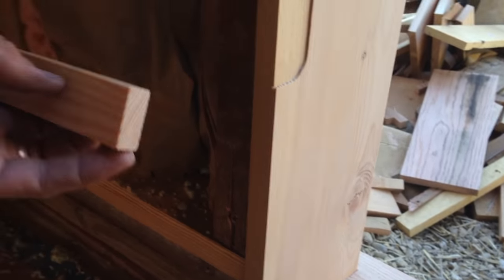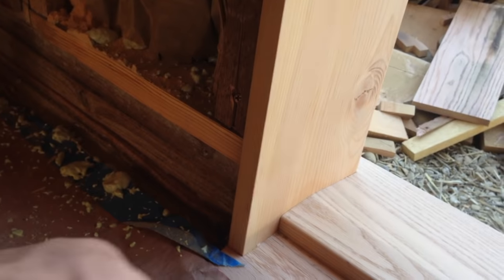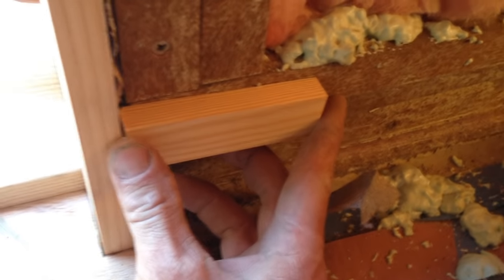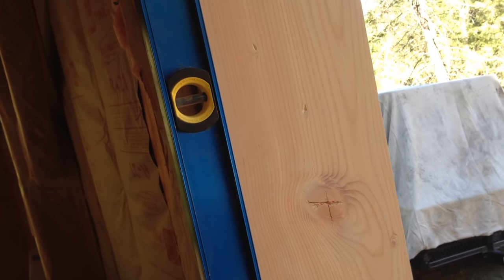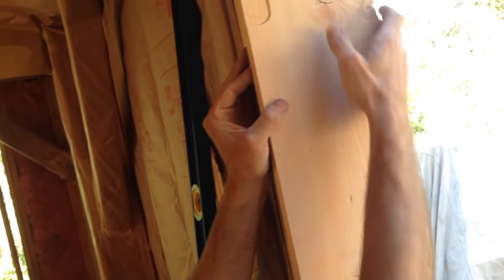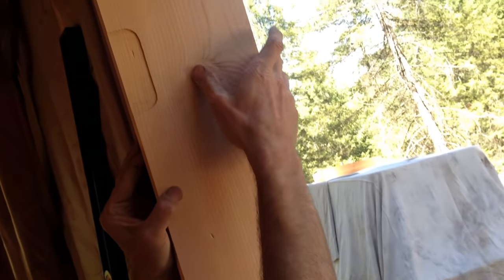And then I want to know that my drywall thickness will actually hide behind there on both sides. That's not quite making it right there, but that is, and I'm still proud on the outside there. Also, I take a quick look this way, and with a little adjustment, that'll be plumb. I know that if I locked it down there, I would be able to adjust this way and that and still be able to hide my drywall thickness and be just proud of that surface.